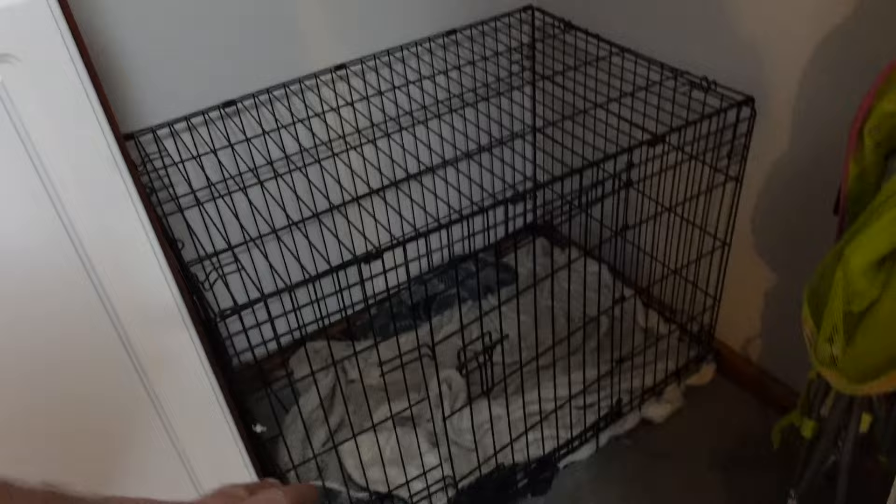Here's the next spot — we're going to do some shelving. Moved little Angus out here and it's been nice to have him out here, and he likes it. We want to be able to use this space a little better, so we're going to do a shelf right above the kennel and then one about halfway up. There's really no way to do a two-foot wide shelf without having giant brackets unless you do a ledger. So what we're going to do is use a one-by-four ledger across — it's going to span the full 36 to 40 inches. Also, home gym — check it out. Allison's been parking in the garage.